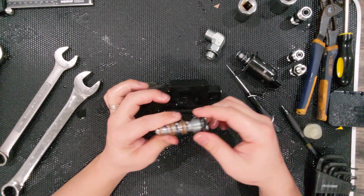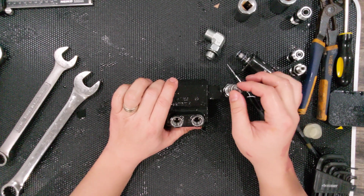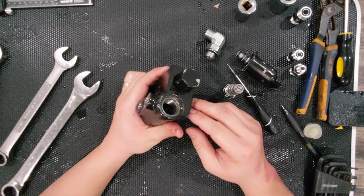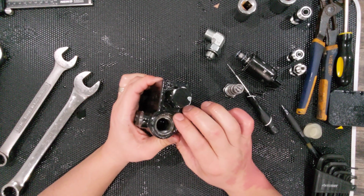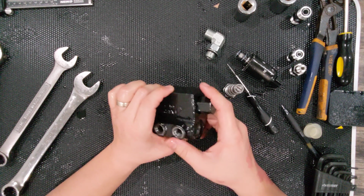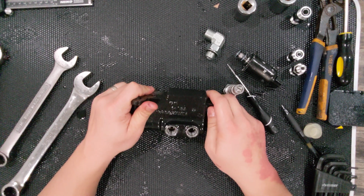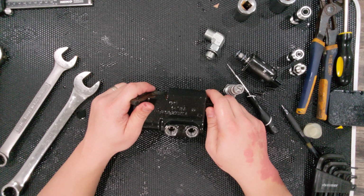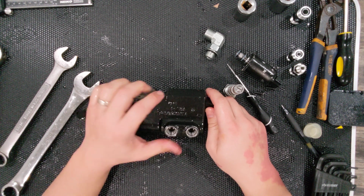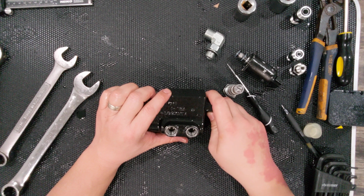So again, that's really why on the John Deere you're always going to see fluid going to both circuits. But this is part of the key to changing the plumbing, so that this is no longer a restriction point, and we can get any excess flow to the implements. That's where we want to use most of our flow. And if you think about the cylinder on the front of the tractor, the fact that it would need 3.5 gallons per minute doesn't make sense. The ram is probably not even an inch, and it doesn't have a very long stroke.